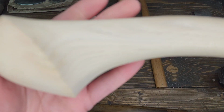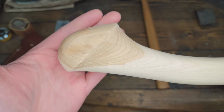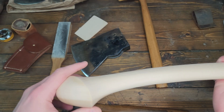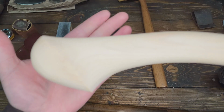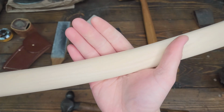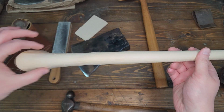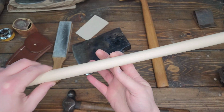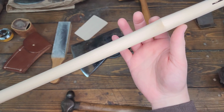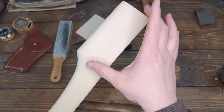If we can get that to focus, I have shaped up the palm swell in my usual scroll end. The Whiskey Rivers are really set up nicely to do this. They shape very easily, significantly easier than the house handles, though they're a bit more expensive, they are a nice handle. I thinned it down a little bit in this direction, so we've got a slow taper from here to the center, and then it stays about the same until about here. Then we slowly get wider as we get up to the shoulder. This big, tall-eye jersey needs a tall tongue in order to fit on it.